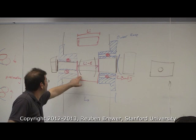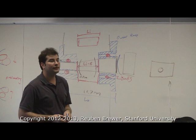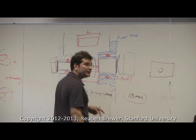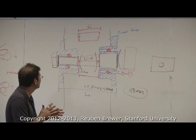Let me give you a hint. This is 12.7 millimeters. These are 0.7 millimeters. What else do we need? Like a shim. A shim? How many shims? So 0.7, 0.7 is 1.4. So what is that? That's 11.3 millimeters. So we'd need something that's 11.3 millimeters, right? Or something around then? We need something precise. Not really. I mean, the Belleville washer is compressible, right? So what are you doing? The diameter, or are you doing the length?